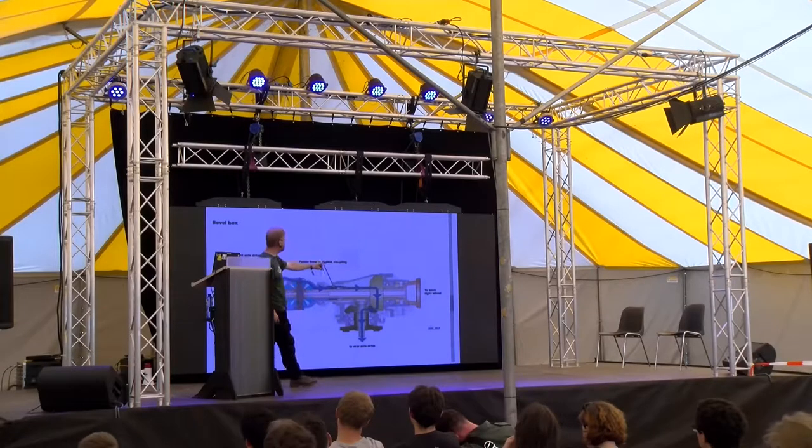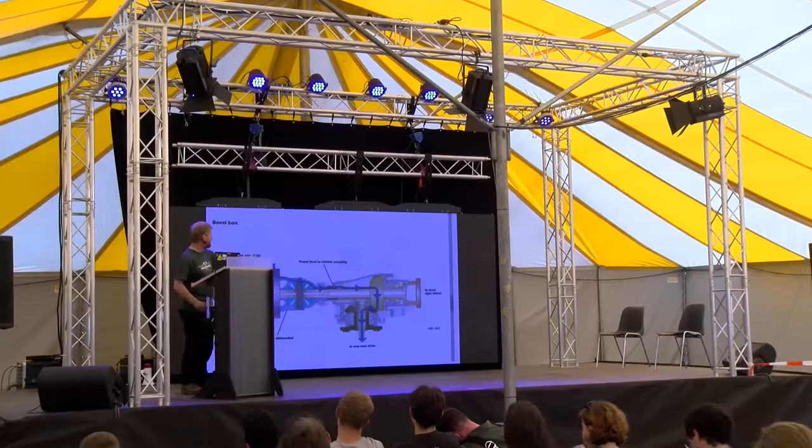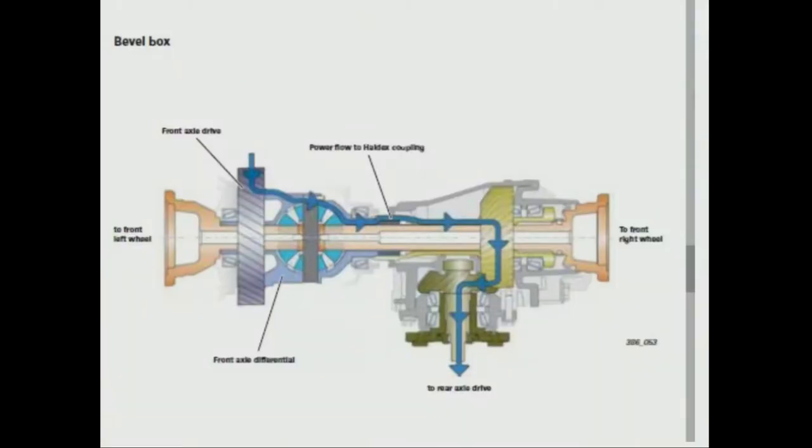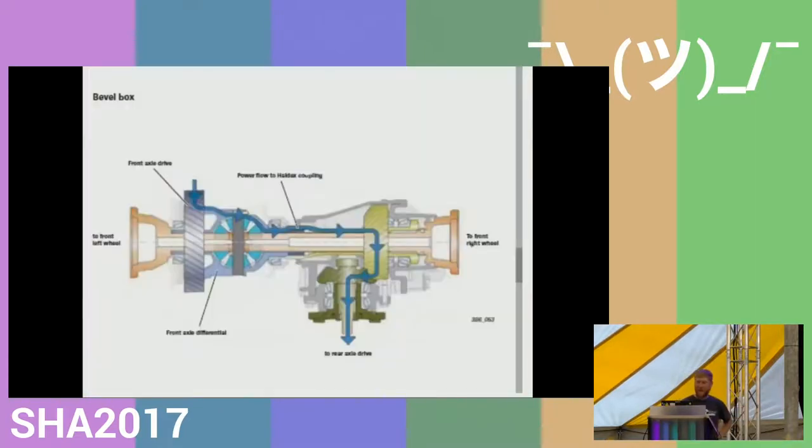Is it red output shaft connects to a different part of the differential to the yellow gear on the transfer. So because of that, because I bought just the bevel unit, I then had to go out and buy a whole gearbox so I could take the differential apart and remove from the differential one of the little gears and turn down one of the ends of the gearbox, because I've not shown it here, but both those parts go into separate splines